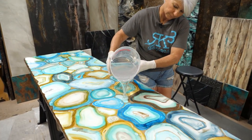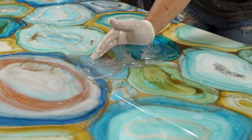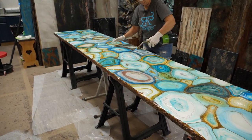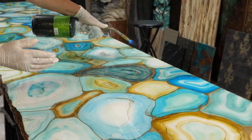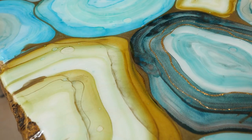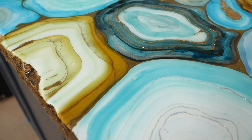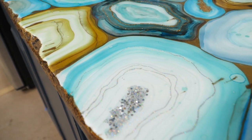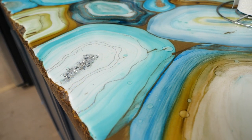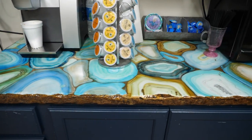Our final flood coat is just clear epoxy at three ounces per square foot, applied just like the last coat. 24 hours after we poured the flood coat, we applied the Ultimate Top Coat in a glossy sheen. Check out our YouTube video on the new Ultimate Top Coat for detailed instructions and tips on getting a flawless finish. After we roll on the UTC, give at least 24 hours dry time, and then we recommend one to two days before installation and full use.